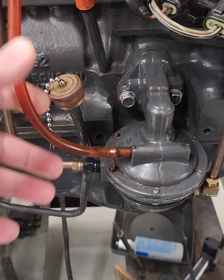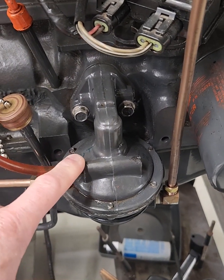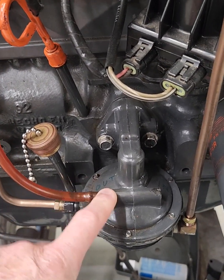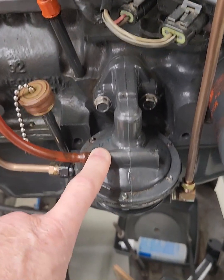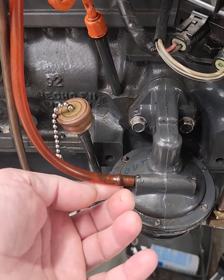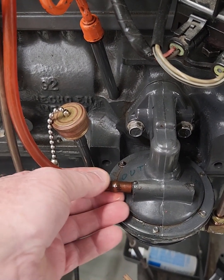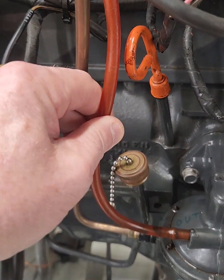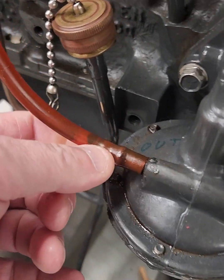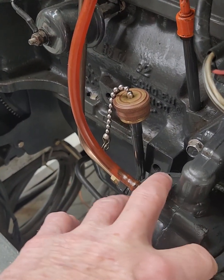This hose being hard — being in the bilge of a boat, you may not think about it, but periodically check this hose. Just reach down and feel it, and make sure it's not split or broken. If that hose fails, gasoline can leak into the bilge of the boat, and you don't want that. Check it every year in the spring, maybe once or twice during summer. If it starts to get hard and isn't soft anymore, it needs to be changed.